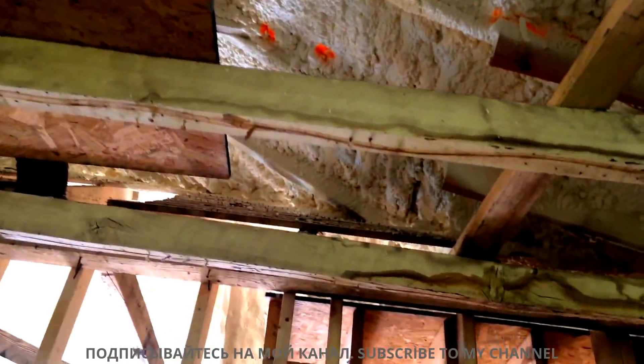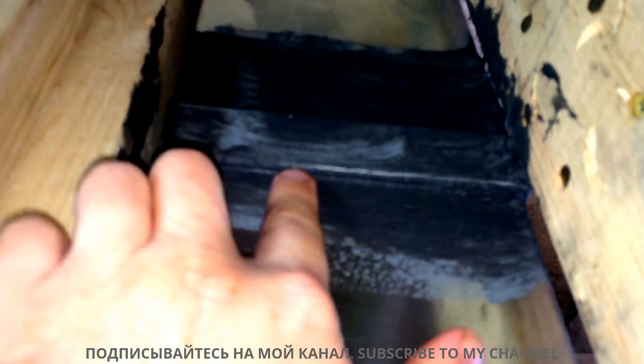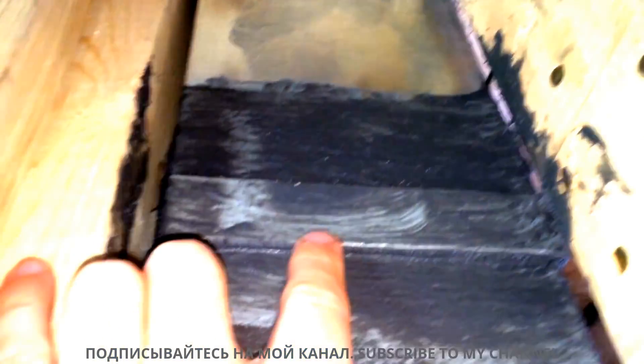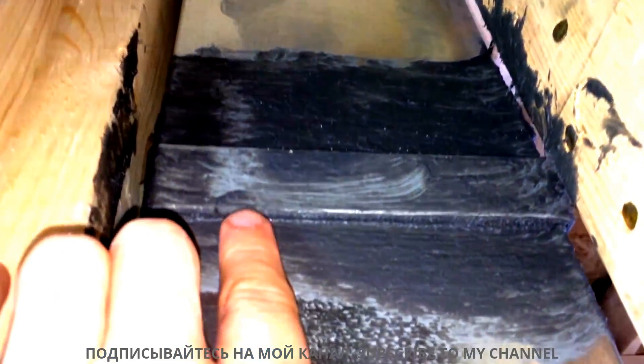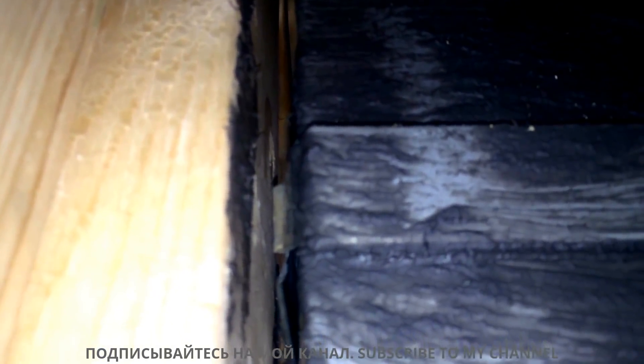The last thing to note is they've done a pretty nice job of sealing the joints. This is mastic right here — it also uses a tile glue. It's not quite as thick as I'd like; the rule of thumb is thick as a nickel, and that's not quite there. And there's one joint right up in there that definitely didn't get hit, that we're going to need to figure out.